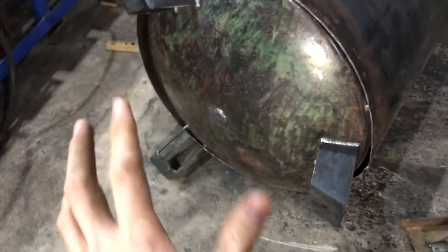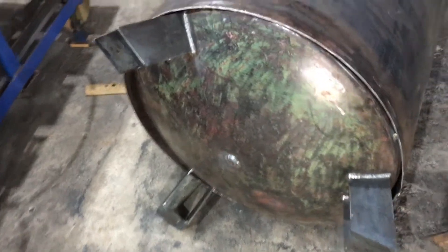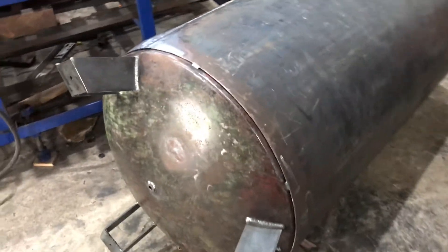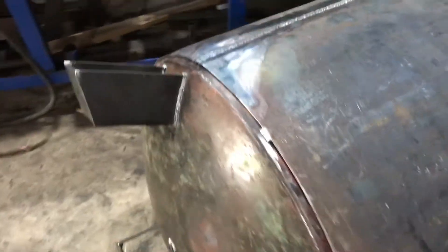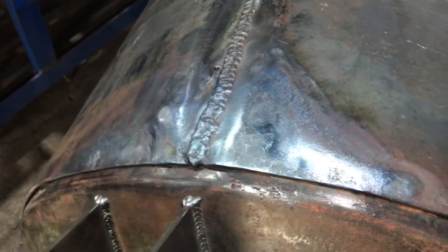We stuck the lid in sideways and then started hammering it up — we got it in a little too far in a few spots but we can just hammer it out. I put in a tack here at the distance I want for the gap, and then we brought it away from that. Here it is — I got it all tacked up, close enough and nice. There's a little bit open where the weld seam was, but I just heated it up with the oxyacetylene and tapped it back down.